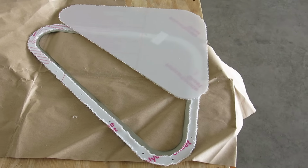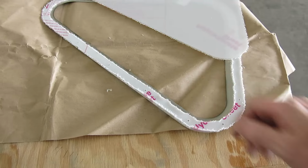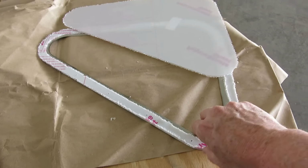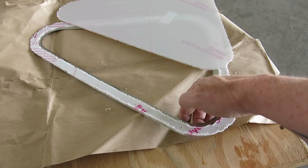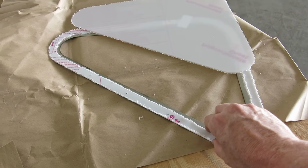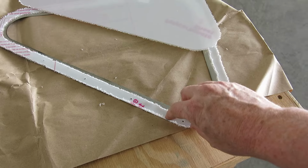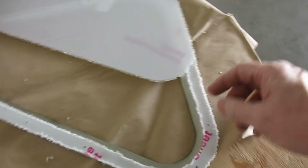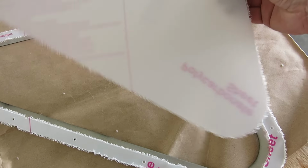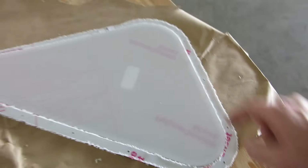Getting started on these rear windows, we had previously painted the inside part of it. It's painted black. Okay, we've got our window. The window retainer is the metal piece, the aluminum that we've got painted black on one side, and I don't have it painted on this side. And then we've got the spacer here, which is just a polycarbonate piece that's cut. As you can see, it's cut just a little bit smaller than this. Then the window itself will just sit in here, and then this gets riveted onto the fuselage.